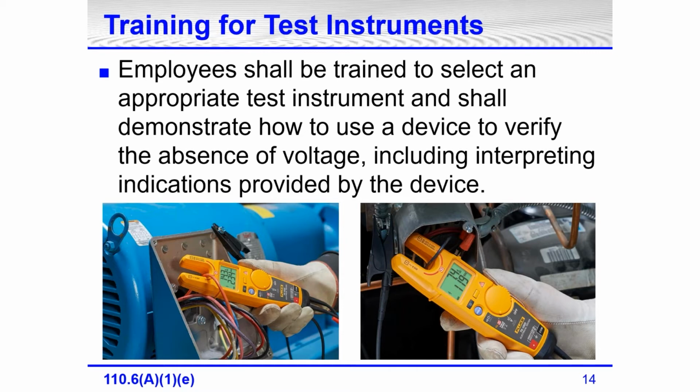You can see in the picture here that it's just taking the current measurement. It's amazing that the forks don't have to close, because normally with amp probes we have to put the clamp around a wire, where the clamp closes around it. This is an open fork, which is amazing. The other thing is this meter reads voltage and current at the same time. Fluke has a model below this, the T5-1000, and it will read voltage or current, one or the other, but not both at the same time like this one.